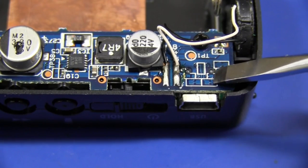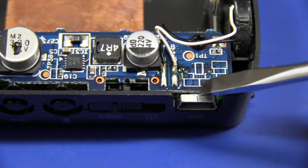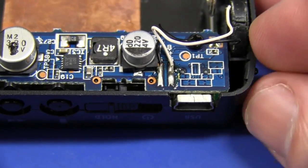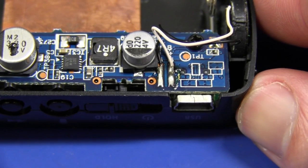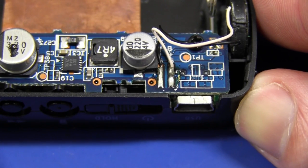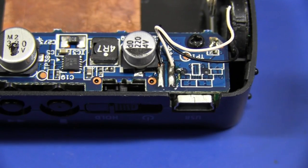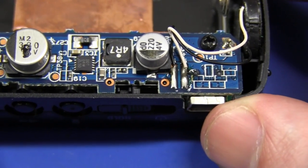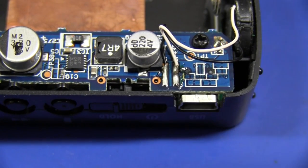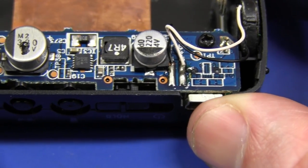Check out the footprints there for those little surface mount resistors or capacitors - they've got no solder mask removed. So they've decided they don't want to mount those components and they've actually closed off the solder mask for those pads. There's no solder on those pads at all. That's not that common - usually on unpopulated footprints you would just leave the solder mask open and you'd see the reflow solder on those pads, but not in this case.